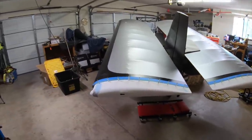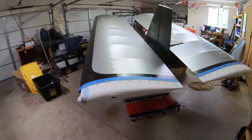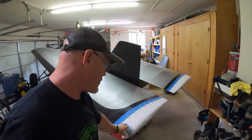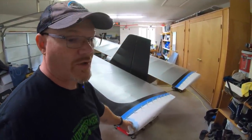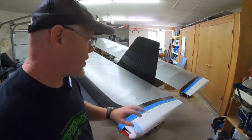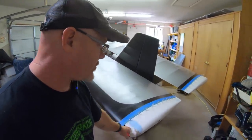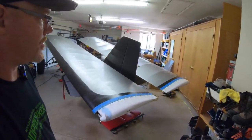All the bodywork's done, final sanding's done - just need to be cleaned up and primed. I'm on my third day with these. The main reason for that is you can get a couple hours of work on it, but when you have to put more superfill in to do the bodywork, once you put that on you have to wait overnight for it to dry to the point where you can sand it. So you kind of work them, put the fill on, set them aside, go do something else, come back the next day. Everything's drilled, mounted, and ready to go.